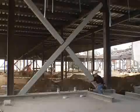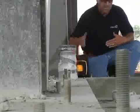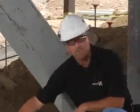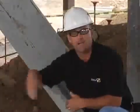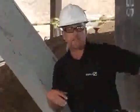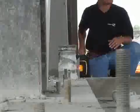If you look out of the top of the laser here, I have a beam coming out. That beam is a 90-degree beam. No more doing 3, 4, 5 with a tape measure or a large reel tape. All I have to do is take this laser beam here and transfer it down to the concrete here, and I've got 90 degrees automatically. Fastest way I found to do it, I just grab my speed square that I have in my pouch anyways, and I set it down on the concrete, I slide it into place, I split the beam in half. It's really easy to do.